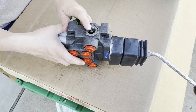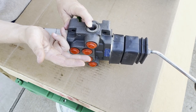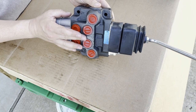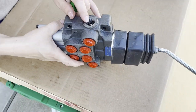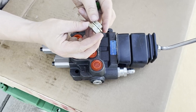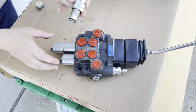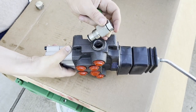Every tractor has one of three hydraulic setups: open center, closed center, or load sense. We're not getting into what the difference is between those in this video — that's in another video. This particular valve is designed to work with either open center or closed center tractors. Valves always have to match the hydraulic setup of the tractor. So in this case, with this port, if you have an open center tractor, you're going to put a hydraulic plug — a threaded section with a cap — directly into that port. For closed center, you would have what's called a sleeve installed in that port, and the sleeve has a cap on it.